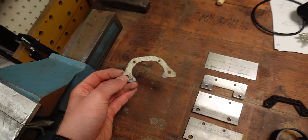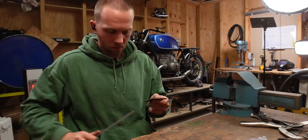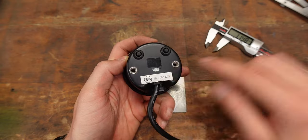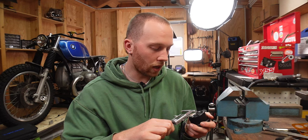As I've said in my last video, the bracket for this speedometer was my very first fabrication project, done about two years ago, and I struggled a lot with getting the correct measurements for the mounting points. So I quickly want to share how I'm doing it now — this might be super basic if you've already fabricated a few things, but it would have helped me so much two years ago. To make my life easier, I started with a square piece of two millimeters steel and marked the center. That way I can draw the circle and I already have the two center lines. If you have something like this, you always want to look for center lines that you can reference. In this case, the two screw holes are perfectly in the center, so you go ahead, take your digital caliper, and measure from center to center to know how far they're spaced out.